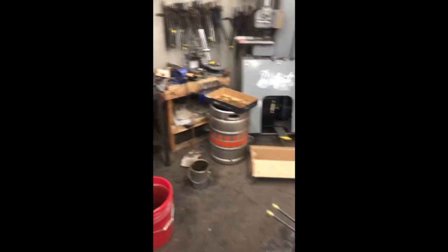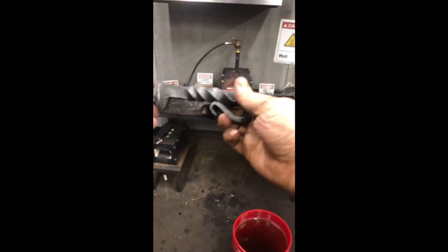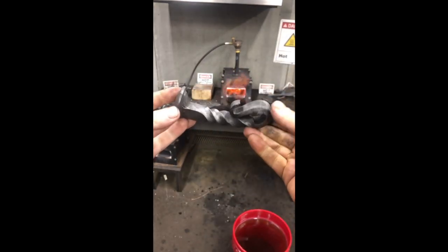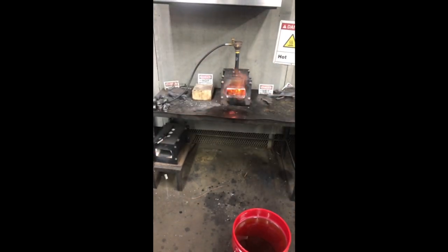However, that process also took off all the oxide, and we need that oxide layer to be back on here. So we're going to heat them back up - this is the quick and dirty method. We're putting them in the forge for a little bit and then we'll pull them out. They started out nice and clean with all the scale off, which was really easy to do by letting them soak in vinegar.